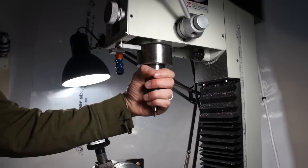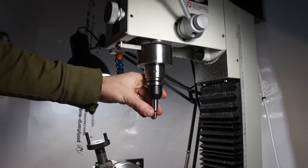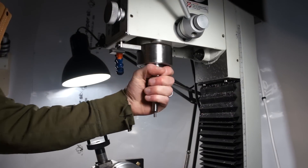What that does is it basically lets you set a bunch of tools offline, measure them up to your offsets you need, and then quick swap them in while the program is running without having to take out a taper every time. So even though I don't have a power drawbar, that's going to be hugely beneficial to me. The next thing I wanted to do is organize the tool system so I didn't have them laying everywhere — my old tapers were just laying on a table on a big cloth, which is so annoying and does zero for productivity.